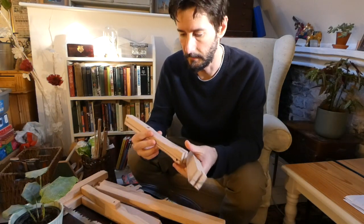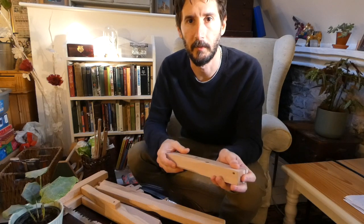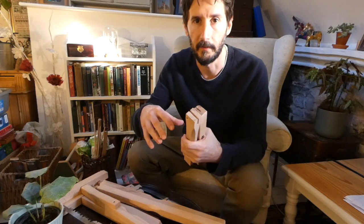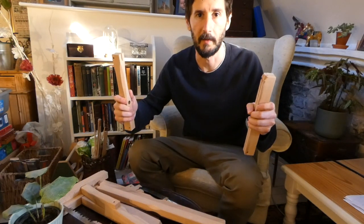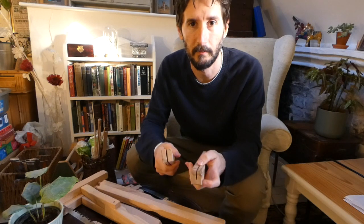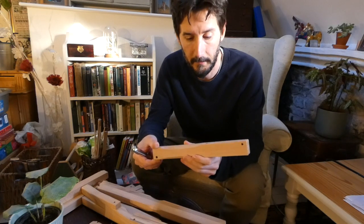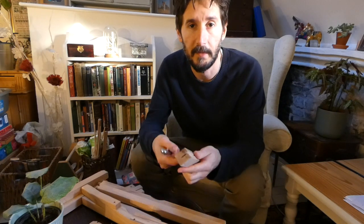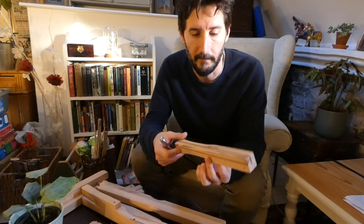It's a really good tool to take out when you're camping or foraging for wood — any time I go out collecting wood I'll take it with me. It's just so quick to take apart and put back together and I can just stick it in my backpack, because obviously when it's all assembled it's quite big, so it's not so good for carrying around like a normal bow saw is. Once they're all burnished I'll give them a coat of linseed oil — for these ones I use boiled linseed oil just because it dries much quicker, so I can apply it and it'll be dry in like half an hour, and then I'll assemble them and put the blade and cord across.